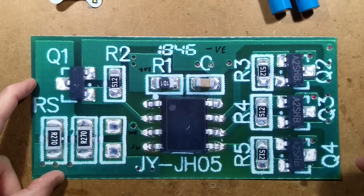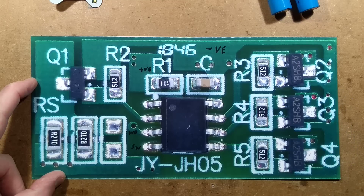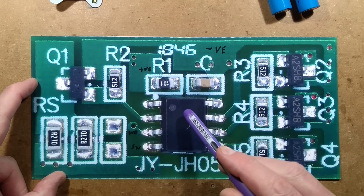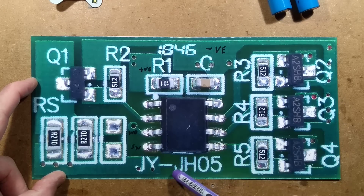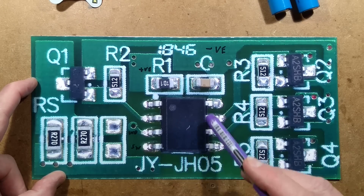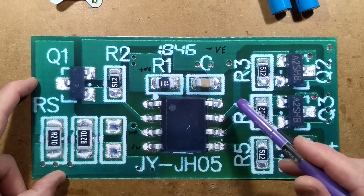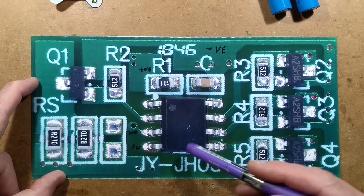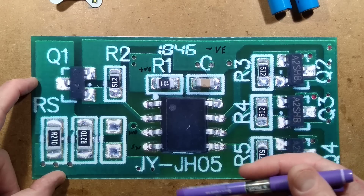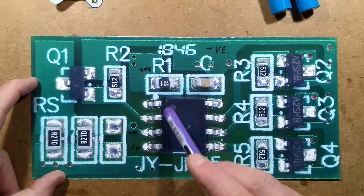That's better. This is what I should have done in the first place — go straight to the big zoom-in picture because it shows so much more detail. Here's the microcontroller in the middle; this is almost certainly going to be one of these one-time-programmable microcontrollers, very common in Chinese products. They cost typically just a few cents — a mass-produced microcontroller for applications like this. Because of the pin-out, you could theoretically write your own software for a similar-pinned microcontroller and get rid of those flashing effects. To get rid of the flashing, you'd have to reprogram the microcontroller.